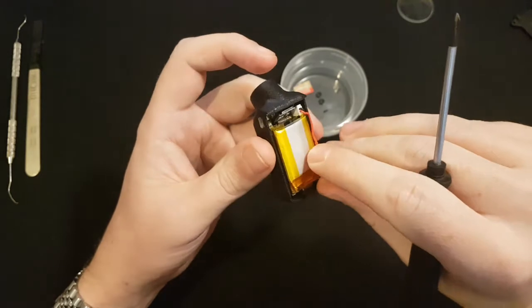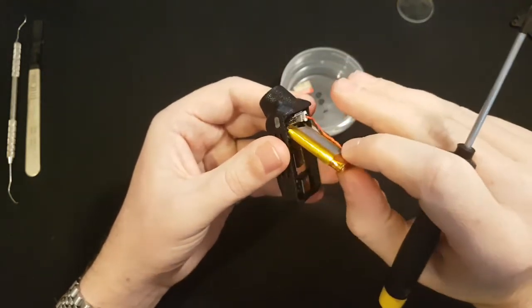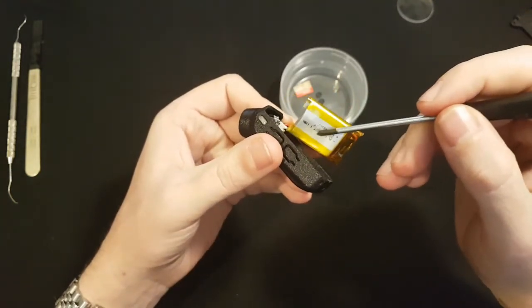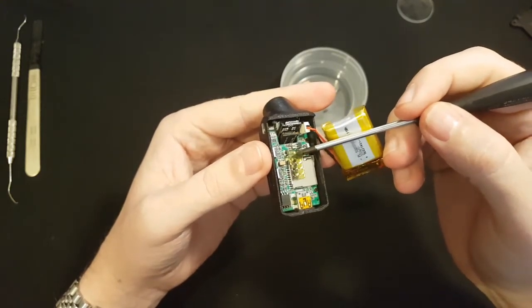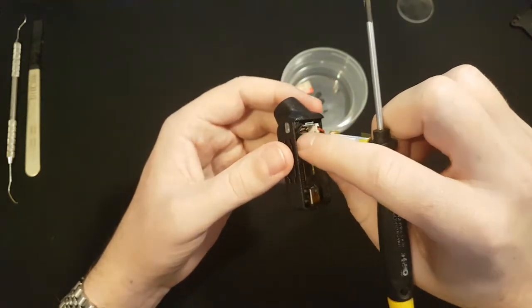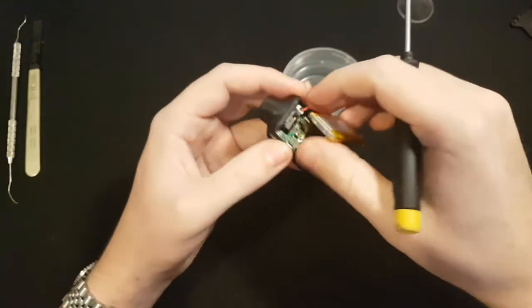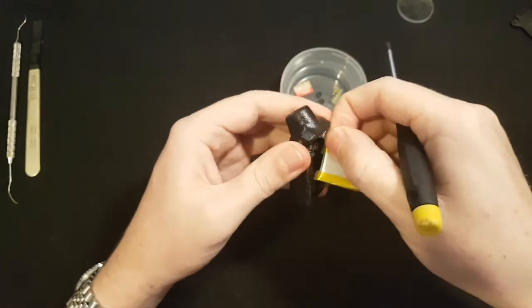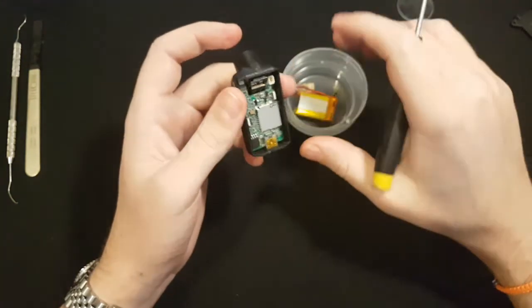It turns out the battery is actually the lightest and best option for this. When you pull your battery off, there may be a little bit of double-sided sticky tape. I've got a little bit of silicon gel from a cell phone dash mat in there just so there's no chance the battery is going to bounce around while you're flying and cause your video to be shaky. Once you pry the battery out, try not to wiggle it around too much — these are kind of stiff leads. Just disconnect it from that JST plug and put it aside.